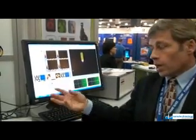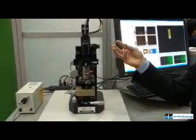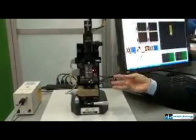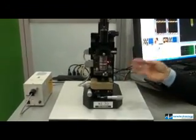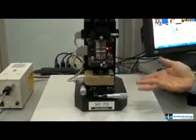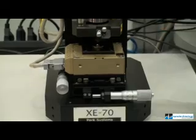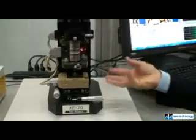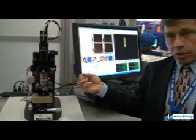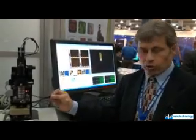The XE70 has many instruments in the family that graduate and increase in size and capability. This instrument can do anything in the microscopy field, from imaging to looking at lateral condition, magnetic and electrical condition. We can scale up the instrument. We can pass a beam through — we can be transmissive or reflective, we can look through a material. We can also look at the electrical attribute by incorporating a different material on the end of our tip.